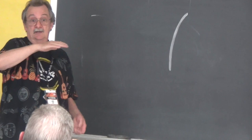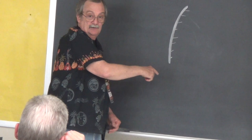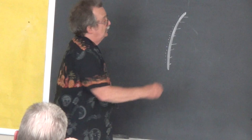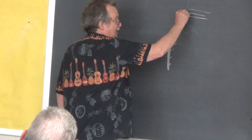So if you can make a template that is going to fit here, then you can lift the neck out, scribe it, and you have your points out here. Then the line in here, this line is critical, this line is not. As this is coming up into this material, you want to create this nice miter. These aren't going to be 45 degrees, they're going to be whatever they happen to be, so you want to create this miter right here.